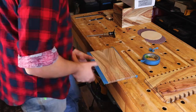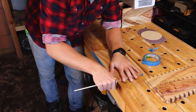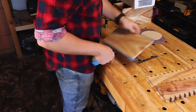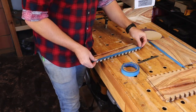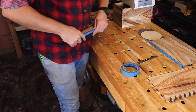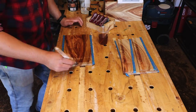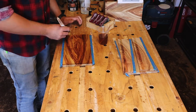I'm going to pre-finish the inside space before glue up. So I'll tape the edges of the shelf to maximise glue surface on the shelf dados, and then tape the fingers of the box joints. For the finish I've used a mix of boiled linseed oil, exterior varnish, and turps. It looks great, but I didn't love the actual finish with this mix — more on that later.